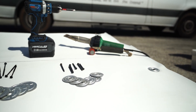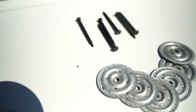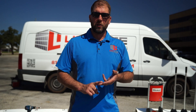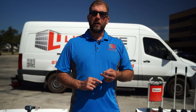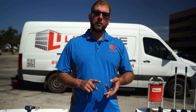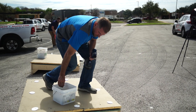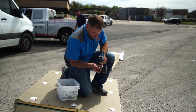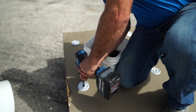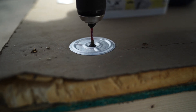Let's talk about the mechanically attached system and what we're going to need to do that system: drills, piranha plates or membrane plates as they're known, insulation plates, and then we have two different types of fasteners. We'll have a number 12 and either a number 14 or number 15 depending on the deck. For today's demonstration we have a wood deck, so we would use a number 14 screw to hold the membrane plates and a number 12 screw to hold the insulation plates.